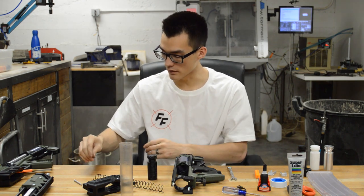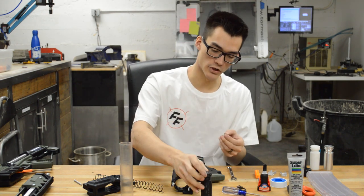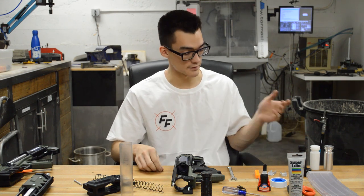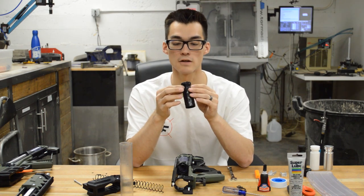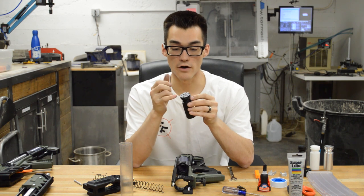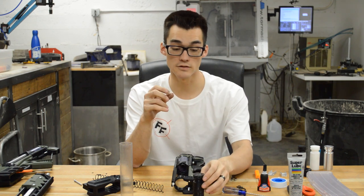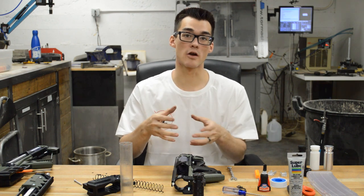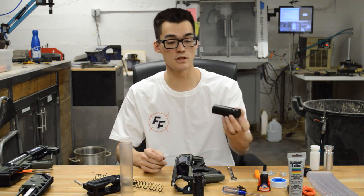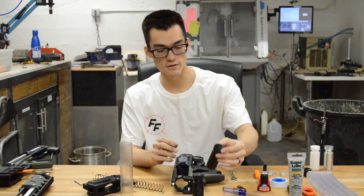That's normal for PLA, so we recommend replacing your plunger regularly or upgrading to a machined plunger in acetal or aluminum. That gives you a better seal as well, because 3D printed plungers can have tolerances that vary quite a lot on where the O-ring is seated. If printed with default wall thicknesses you can have small gaps between layers causing air to leak out. A single-piece machined plunger is a little heavier but gives more consistent O-ring notch tolerances and a better air seal.